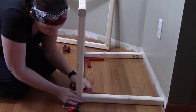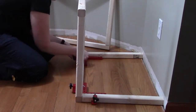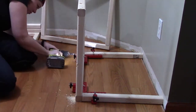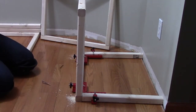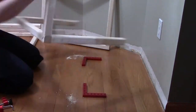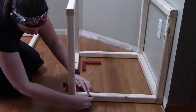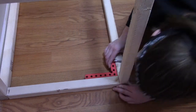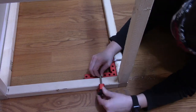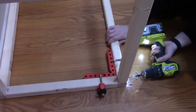I need to make sure I have enough space for mounting those drawer slides, fully enclosing that litter box, and installing a drawer face. The nice thing about having the same height and depth is my spacers are all the same — I'm basically making a square box. And once I had those two frames made, it was super easy to connect them using the same technique I used to build them to begin with.